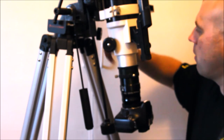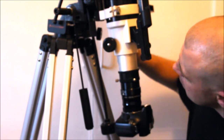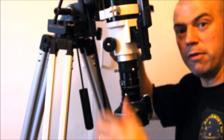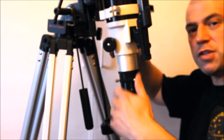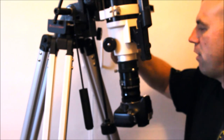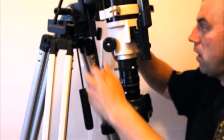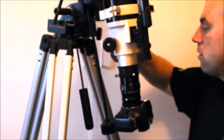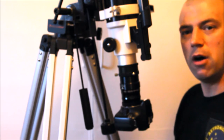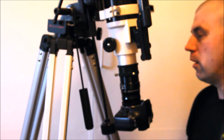Working that grease in there into that gear wheel — brilliant. Massive improvement already, as you've seen from the beginning of the video. You saw how bad the focuser was. With just a few repair techniques to get this adjusted and collimated to your refractor, it's already a massive improvement. This is a lot of weight on this focuser — and don't forget this is an achromat refractor, so it can only take so much weight. That's the exact adjustment you want.